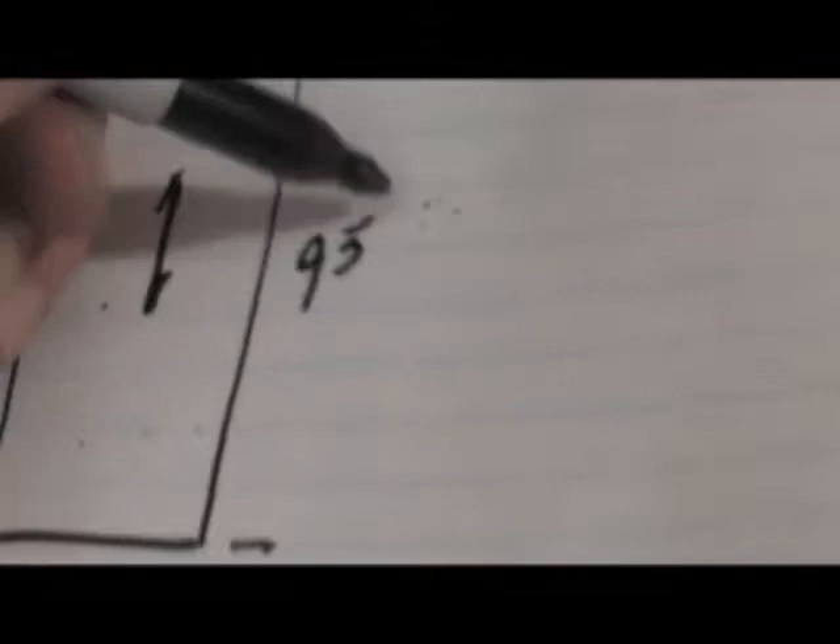There are only two more pieces to measure: the buck and the giant flat that goes against this wall. Start with a drawing, and note that we're still marking the measurements as inside dimension to avoid any confusion at the supplier's. Mark the grain direction on the flat piece so you don't end up with grain running parallel to the floor.